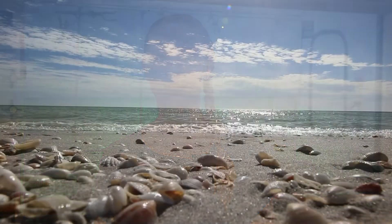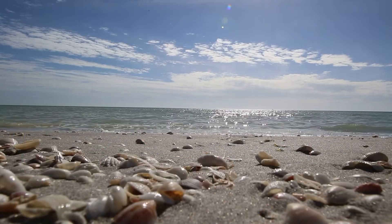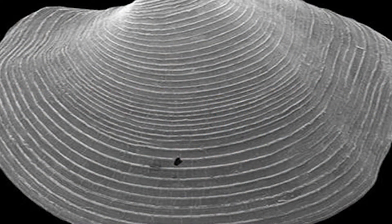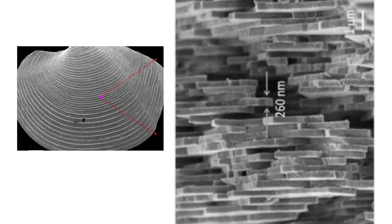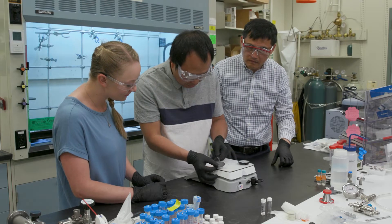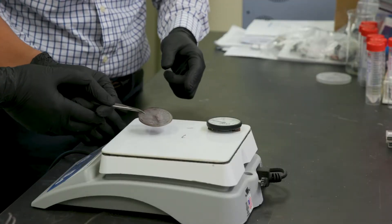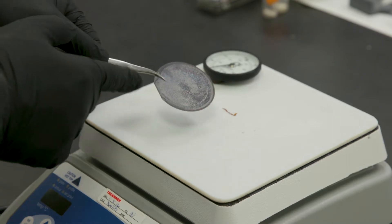If you've ever seen a seashell, you will notice how hard, strong, and resilient that material is in its environment. This is a regular seashell. If we zoom in under a microscope, we see this: the thin white vein is protein, which is the soft organic material, and the brick is calcite, an inorganic hard material. When these alternating soft and hard materials stack together, it creates a very strong material which is over 1,000 times tougher than the inorganic material calcite. This concept of a seashell nanocomposite coating was truly bio-inspired.